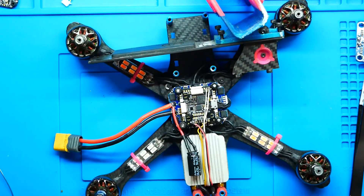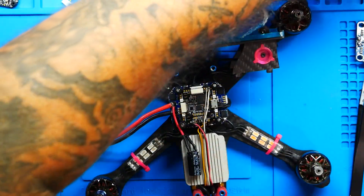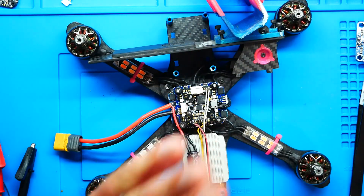We are built, soldered, installed, and ready for action. The only thing I need to do is a test turn-on. Whenever you're doing a swap of a board like this, I strongly recommend that you use a smoke stopper. I have a power supply — every drone pilot should have one. It has built-in reverse polarity protection, meaning if you accidentally bridge a solder joint, connect your capacitor backwards, or your XT60 connector is backwards, your power supply will shut off, stopping any current from passing through.